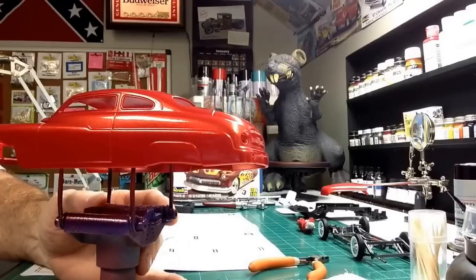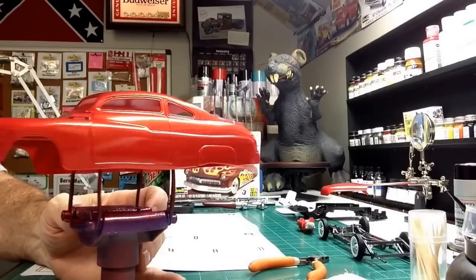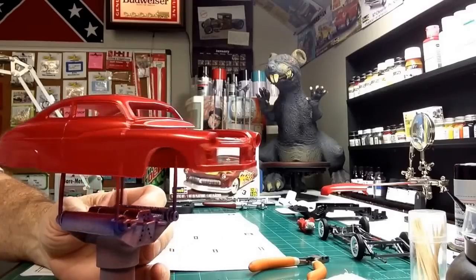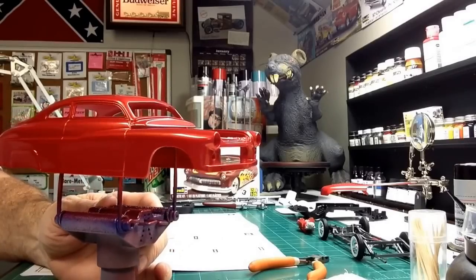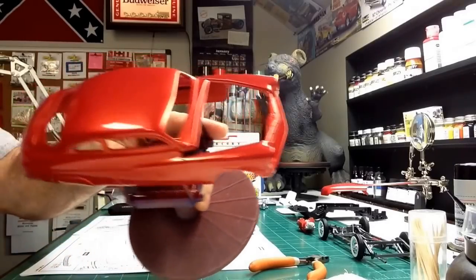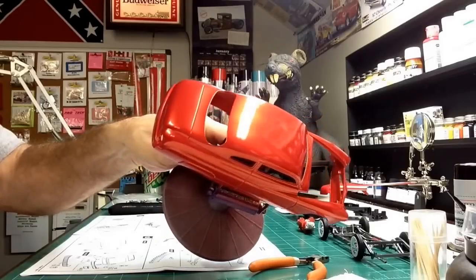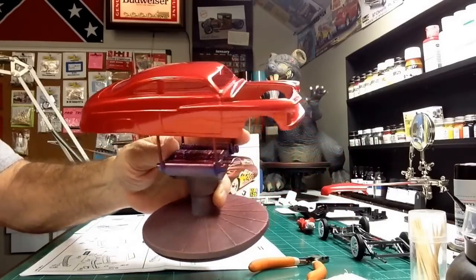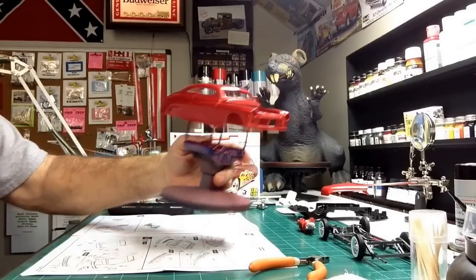I just took my time — three or four light mist coats, then the next couple a little heavier, and the final coat wet. So it's got about five good coats on it. You can really see the shine on the top of it there — she came out pretty good.